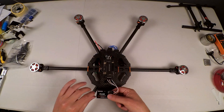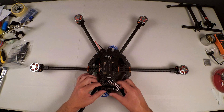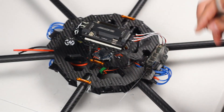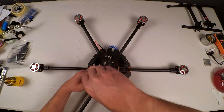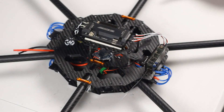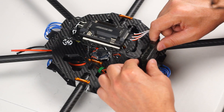What I discovered when playing around trying to figure out where to put my receiver is that it actually squeezes in here pretty well. I'm going to squeeze it in between these, but just so I don't damage the case I'm going to loosen it slightly — that's a two millimeter screw. It squeezes in here pretty tight; I don't want to crack the case, so I'll loosen those so it lifts a little easier.